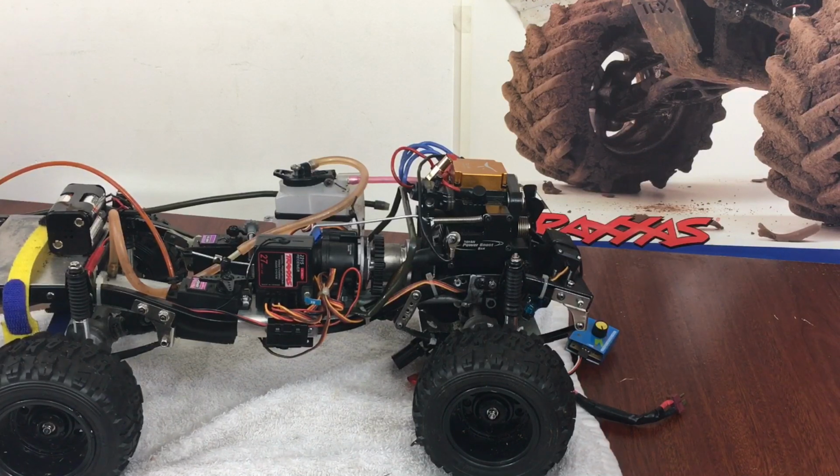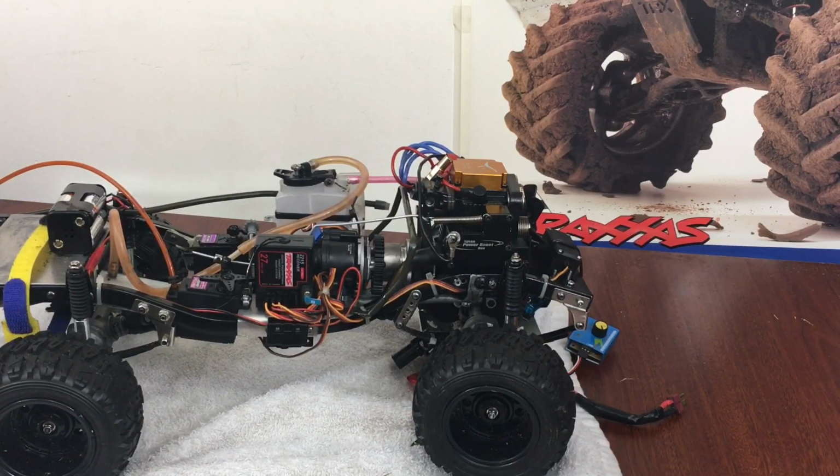I appreciate all you subscribers out there, and if you want to build one of these things, it's a simple combo. You buy the motor. If you get an HPI 407 roller or a frame, you've got it started, and get yourself a Traxxas Revo tranny, a 42 spur gear, and your radio of choice. I mean, there's not a whole lot other than that.